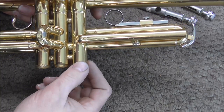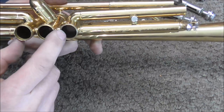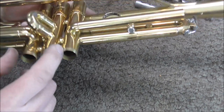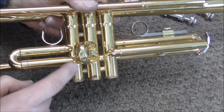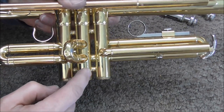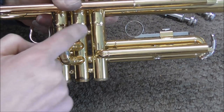So the strength is mainly from those two braces, and sometimes the whole casing can get twisted or bent. When the casing gets twisted, those two braces can push on the inside of the casing and cause the casing to be out of round inside, underneath where the two braces are. This can also happen between the first and the second casings, but it's far less common. It's more common for it to be between the second and the third, or between all of them.